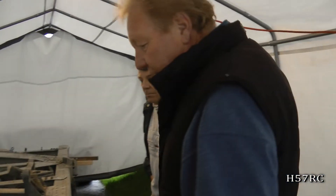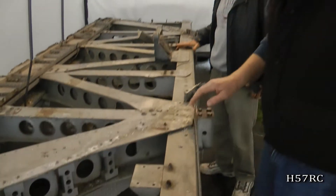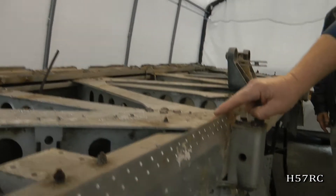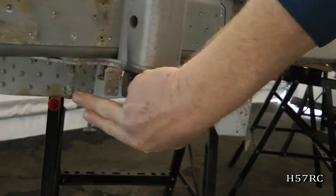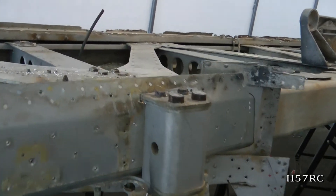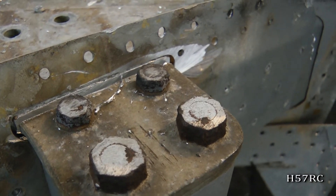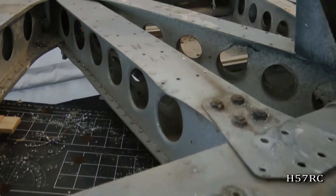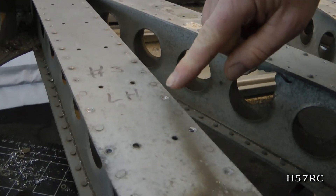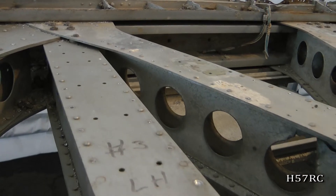So what's been going on, George? Well, as you can see, all of the bolts now have been removed from the spar cap. There are some pretty long bolts in here because they go all the way through. If you take a look at the bottom, you'll see them protruding out. I still have to drive them all the way out — the ones that would move. I still have to get a larger hammer because some of them just don't want to move. Also on the girder webbing section, the rivets have been removed every other hole so it doesn't fall apart, but all that has been accomplished.